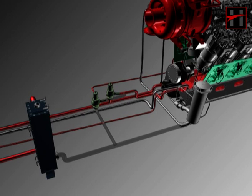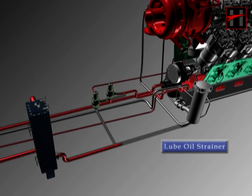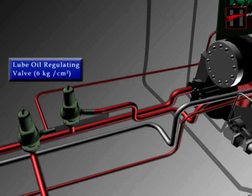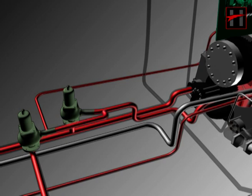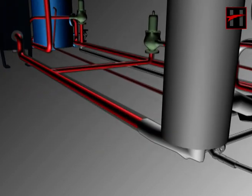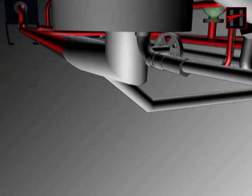In the lube oil cooler, the lube oil after getting cooled by water comes into the lube oil regulating valve and the lube oil strainer, which is located at the free end of the engine roof. The lube oil regulating valve is always set at 6 kg per cm² and keeps the system at the same pressure. If the pressure increases, the lube oil returns back into the sump through the return pipe. Also, the drain pipe cock of the strainer should be closed.